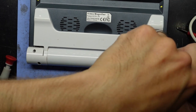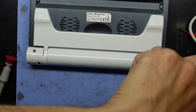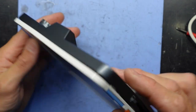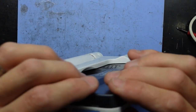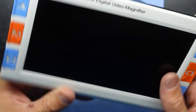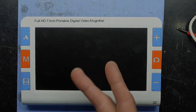So hopefully simply that reflowing of the power jack has solved this. Potentially the clean with alcohol may have also helped, as it was quite tarnished. Put it back together — click, crunch. That's a bit dodgy; I'd say it suffered a drop somewhere along the line. But we are working once more. Hope that helps you guys, and I'll see yous later. Bye.